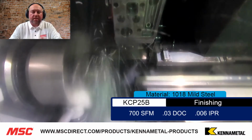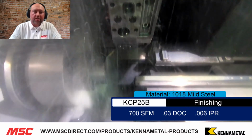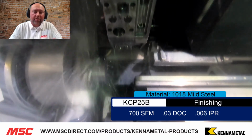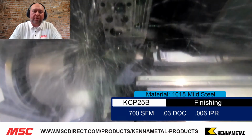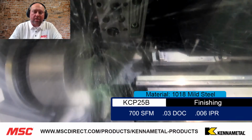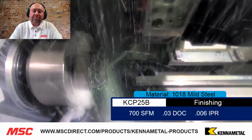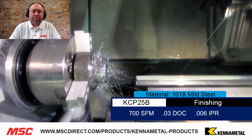Yes, absolutely. Just to highlight the metal removal rates that we're seeing here in this old school method: in the roughing, we were removing about 6.6 cubic inches a minute. In this finishing process here, we're removing only about an inch and a half cubic inches a minute with these parameters at 700 SFM, 30 thou depth of cut, and 6 thou per rev. In your finish here, you're going to be producing a finish. We got some chips hanging up there.